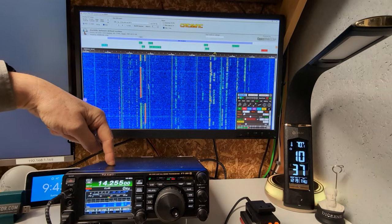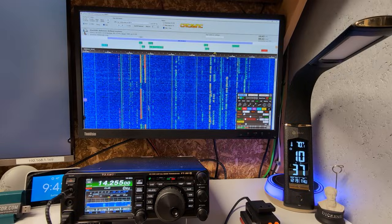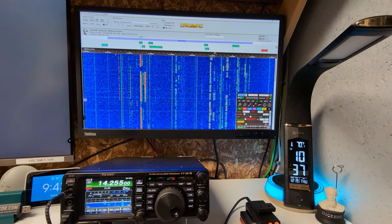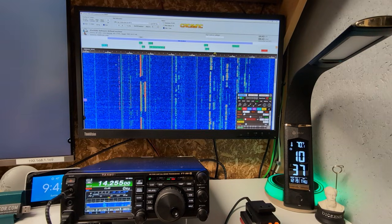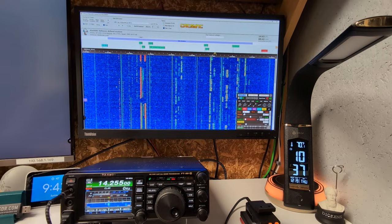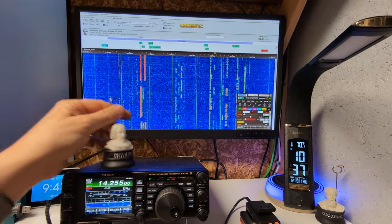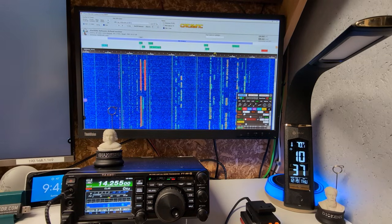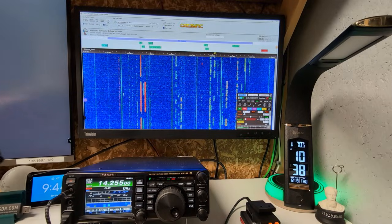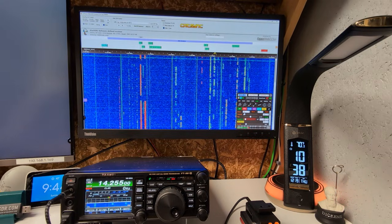This radio has CAT — lots of things have CAT. You might have a radio without a big display, but if it has CAT control, even rudimentary, you're good. There's a piece of software from Afrit that most hams know about called OmniRig. OmniRig lets you mix and match sources and control CAT-controlled radios. It interfaces between your radio's CAT port or COM port and other software — FLRig, FLDigi, you name it. If a piece of software doesn't natively support your radio, you can talk through OmniRig.